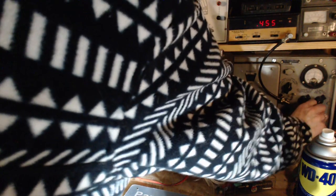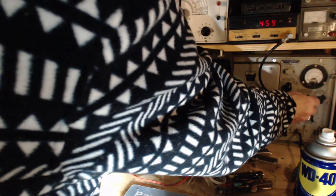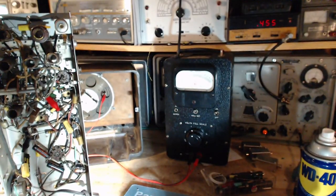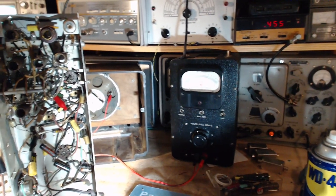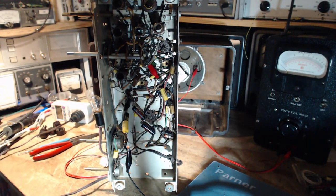Okay, and at level down, let's calibrate this guy now. This up all the way, adjust, make the meter full scale. Okay, I just feel better when it's calibrated. So conceivably, I just take 10 microvolts, multiply it by the multiplier setting down here, and I know what voltage is on the end of the lead here. Not really. You need proper terminations of everything to really know for sure, but it's certainly ballpark. This is good ballpark information,